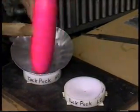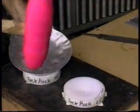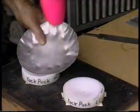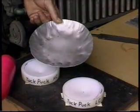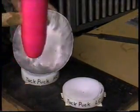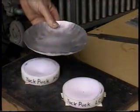You can proceed on around to get as much shrink along the edge as you require. I've left a little bit of the tucks or ruffles there that can be worked out, but in the essence of time, I'm going to just finish this up and make it ready for some light planishing.